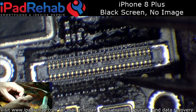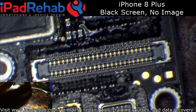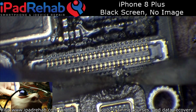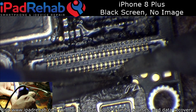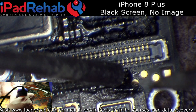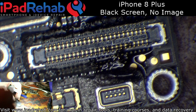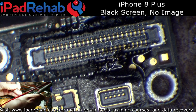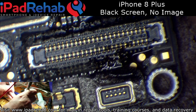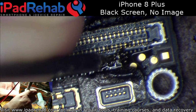Now that that underfill's peeled away, I can feel it just kind of lift right off. So let's see if I can possibly, it could just be cracked solder joints, or it could be damage to the component itself. So I'll see if I can just re-hot these solder joints. Alright, if that is going to fix it, then that should be good enough. But if it's not going to fix it, I'll have to put a new choke in. Oh, my multimeter went to sleep. So yeah, it looks like we need to put a new choke in there.